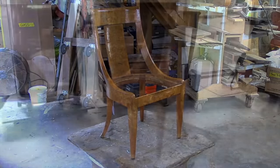So I did it as much as I could with the block. It's going well. Used a lot of expensive sandpaper. After the 220, I'm going over it by hand with 320. Seems to be helping a lot in those last little spots. Still clogs up. And then I'm going to go over it with a gray pad really well. See if I can really even out all the little bit of unevenness I can still see there.